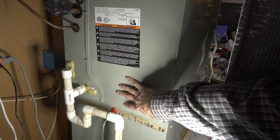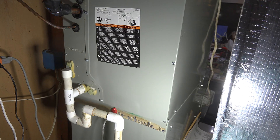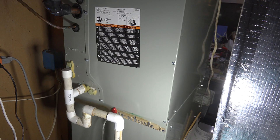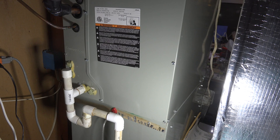That's the very top of the furnace just below the air conditioning coil. You're going to have to knock a hole in there — you've got to be careful about this. You don't want to do it up where the coil is or you'll punch a hole in the coil or the drain pan. You also don't want to hit the heat exchanger. Anyway, you've got to have a probe right there.